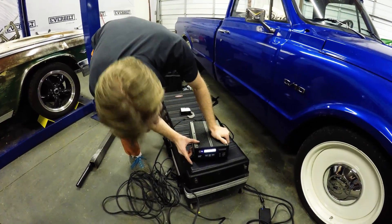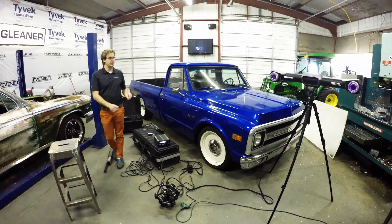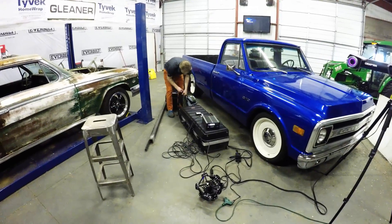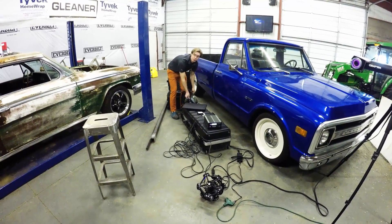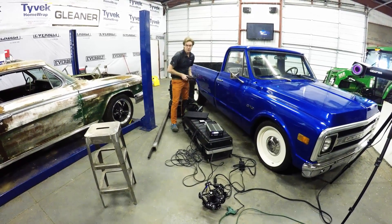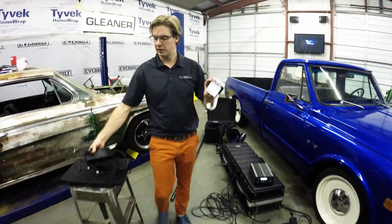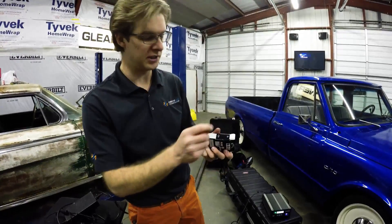We'll plug this also into the back of our controller, then turn on the controller and it will start warming up. The C-track does need to warm up a little because it's so large and thermal expansion can affect it, so it takes about five minutes to warm up. In the meantime, we can get our laptop set up and also start putting targets on our engine — these are just magnetic tags that snap right on. They also have regular sticker targets, which are on this spool — literally stickers that come right out the top. You just stick them on your part and that's what the C-track is looking for.